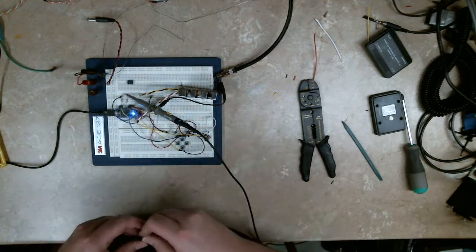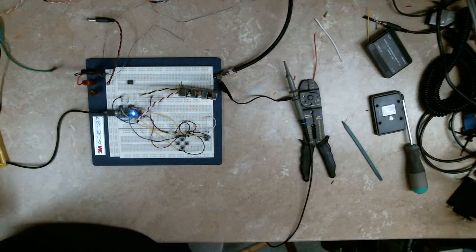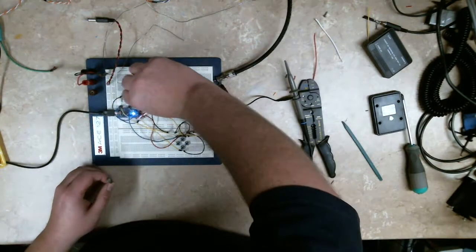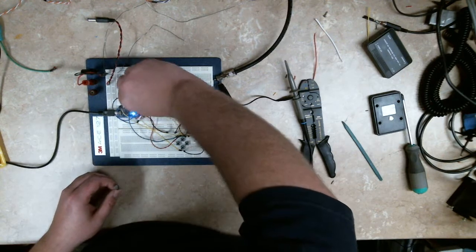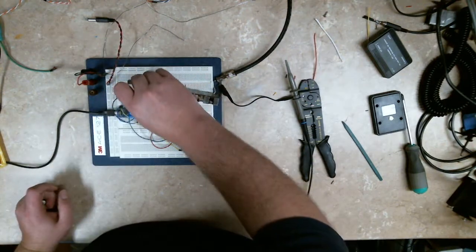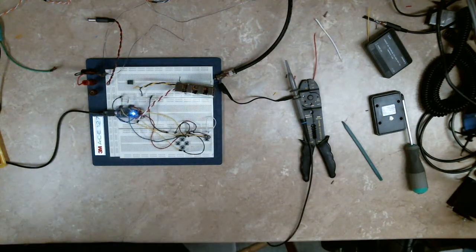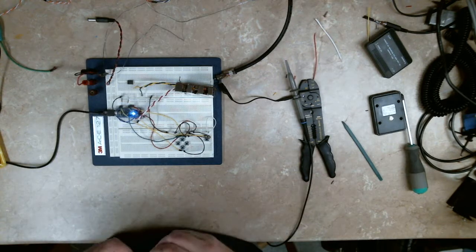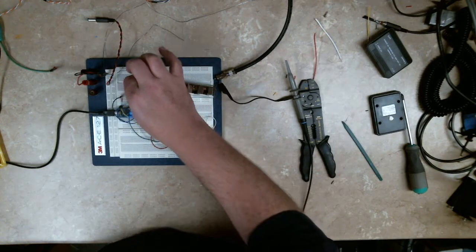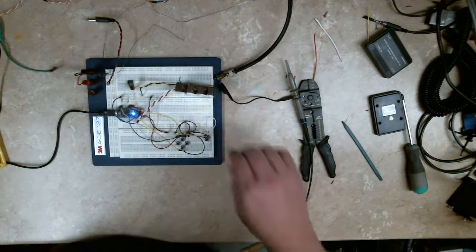All right. So it says in series, right? Right. 220 microfarad in series on composite video. So I'm going to move this little guy over here to, let's split these apart a little bit more. Move this over here. And positive lead always goes towards the thing generating the signal, if there's any question in your mind. The thing that generates the voltage is the thing you want to have the positive pointed towards.